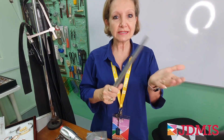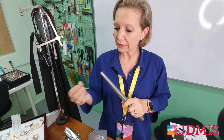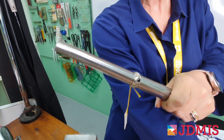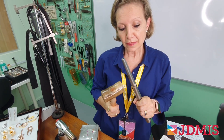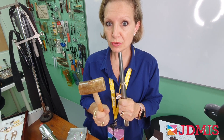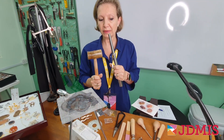One of the benefits is that we have tons of new tools, and the tools are also very useful. You're going to get your very own nice solid mandrel — the main use is to put your rings onto it. You will also get the rawhide hammer. The rawhide hammer is to form and shape anything you like, but when you use this tool it doesn't ruin the surface or displace the metal — it just helps with shaping.